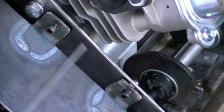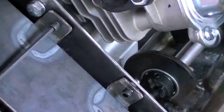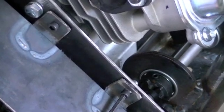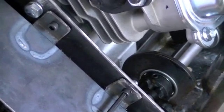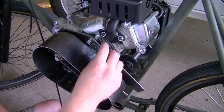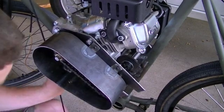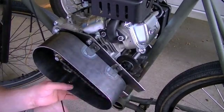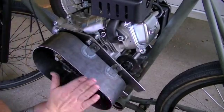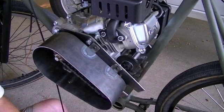Now you're looking at the shroud, the bracket, and the engine bracket. I got two of my number 10 Allen head screws installed, so now I'm just going to cinch these down and show you how all this works. Those are tight, and that's how it goes together. I'm out of these number 10 riv nuts, so I'll go to the store and get some number 8 bolts to match the number 8 riv nuts that I still have, and we'll get this shroud mated in place. The next thing, after I get those riv nuts installed, will be to come in here and trim off some of this shroud — there's a lot of excess here, probably removing at least an inch — and then make a cover to weld to the perimeter of this shroud. But that's it for tonight, and we'll come back and keep working on this.